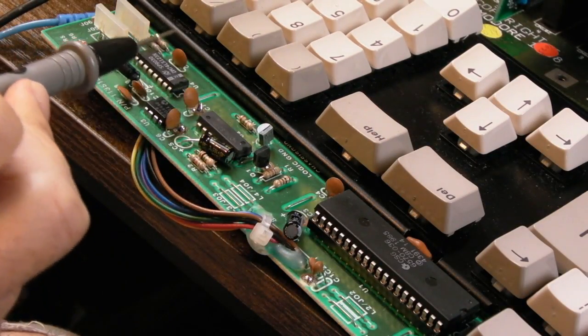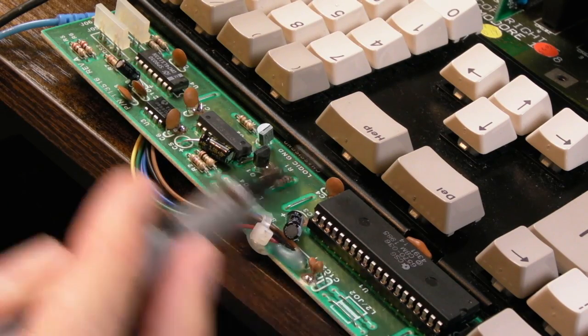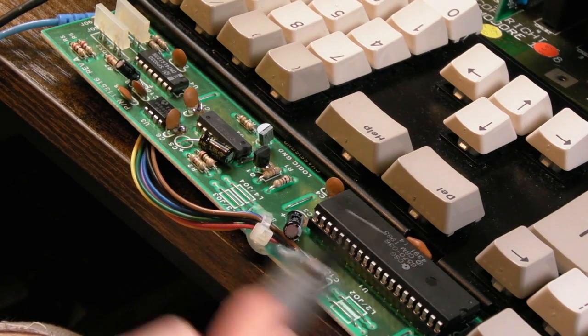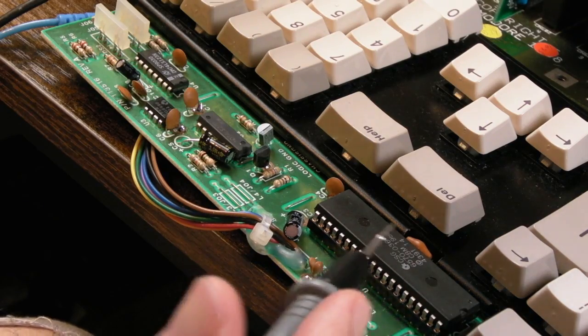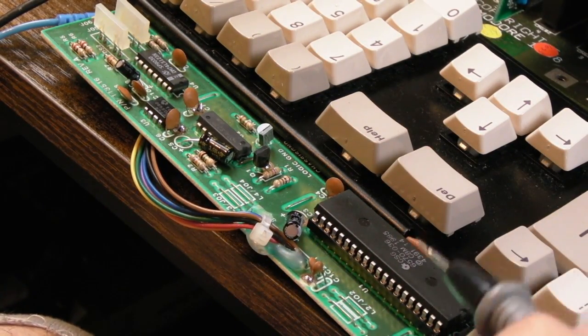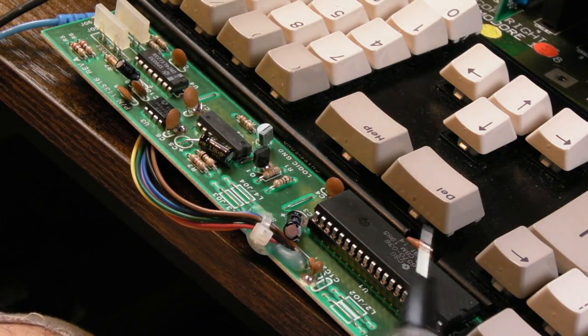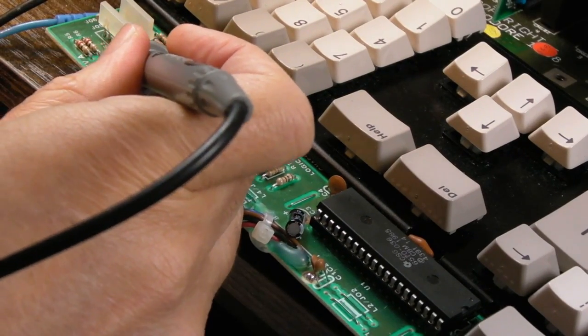So we've got a break in ground somewhere on here, which probably means this has probably not got a ground, or it could have died from latch up or a similar sort of failure. As a result of that, you know, sometimes these can get powered parasitically by their I/O pins and things like that, and damage can occur. You may not think it can, but it can.